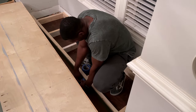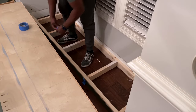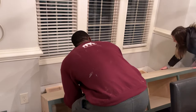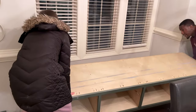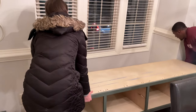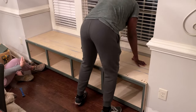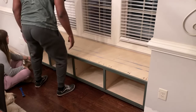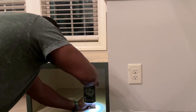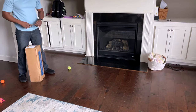Quick tip: put blue painter's tape on the front of your kick plate where the rails are located so when you need to drill your window seat into the base you know exactly where those rails are. We put the toe kick on first, then installed the window seat over it. We really thought we'd have to rebuild because the face frame was too big — but off camera we cut the face frames down 1/16 of an inch on each side (1/32 and 1/32) and it fit perfectly. Once it was in the nook we screwed everything in place, and the painter's tape trick told us exactly where to screw.